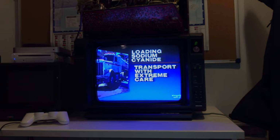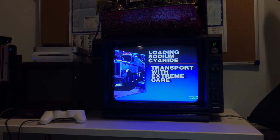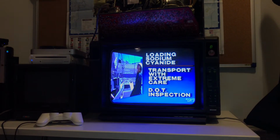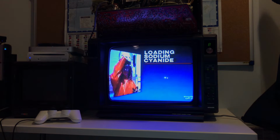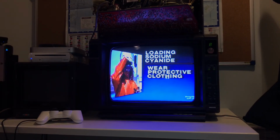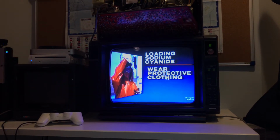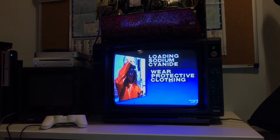Loading and unloading sodium cyanide are two of the most critical stages in handling this chemical. That's because sodium cyanide can escape through loose fittings, cracks, pinholes. Trucks must be pre- and post-trip inspected by order of the Department of Transportation before loading or unloading. Our FMC driver technicians must wear a hard hat, chemical goggles, PVC rain suit, full gauntlet PVC or rubber gloves, and PVC or rubber-protected steel-toed boots whenever they set foot in the loading area. A face mask can be worn over the goggles, but never in place of them.